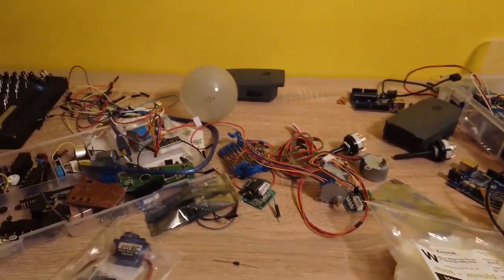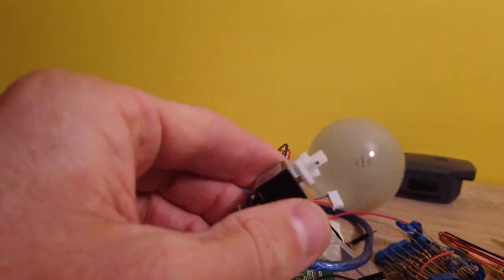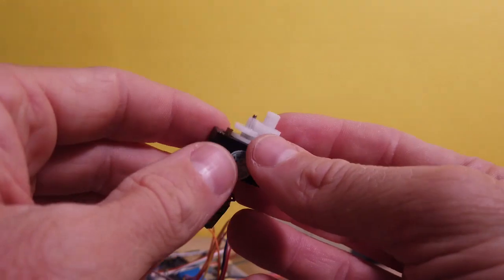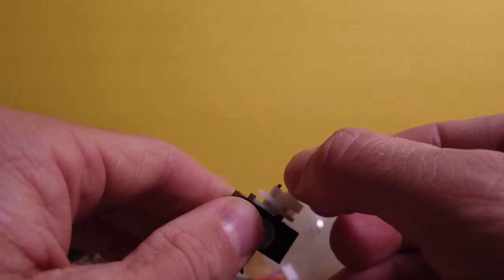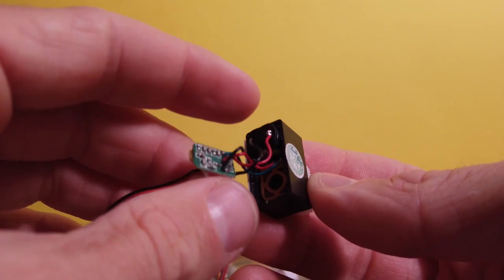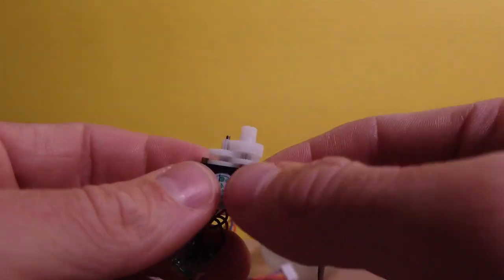I do a lot of fun stuff with electronics and it just occurred to me — the servo that I had at home has quite a bit of punch to it, actually. It's got pretty high torque. Servos only do 180 degree movement. There's a little motor in here, this is a controller board, and they do 180 degrees. You can do pretty accurate turns with it, but you can modify the board to make the servo motor do a 360 degree turn — or a continuous spin — which is ideal. This has super high torque because of the gear ratios.